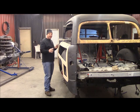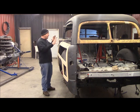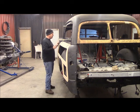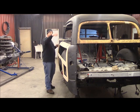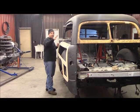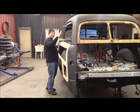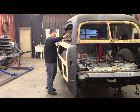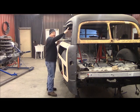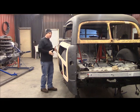Now I've had this together and apart, together and apart, and every time I have to put this to the exact location to know how to move this thing, because I have no exterior panels to work with. I have to do all this with body gaps. Now I have the back window, the back tailgate. That helped tremendously because it let me locate the back of this cab. When I started, the back of your cab was pushed over a little bit. So I got my Porta Power there, and I centered that all up to be exact for the tailgate, then shot those plumbs off the center of your roof, which got the center of the roof in line with the center of the Explorer, and then I can adjust the sides accordingly.